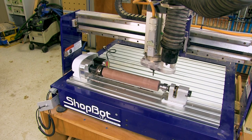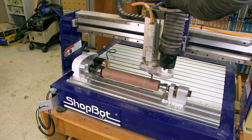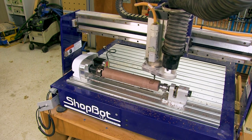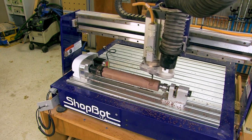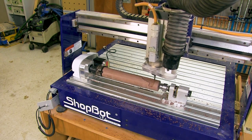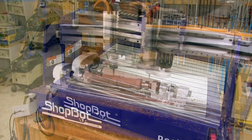When you use a CNC for carving, including on an indexer like this, it's pretty common to do a roughing pass first, followed by a finishing pass — and it's just what it sounds like. The roughing pass is going to remove the bulk of the material, the finishing pass is going to detail it. I'm doing a roughing pass here with a quarter inch ball nose bit.